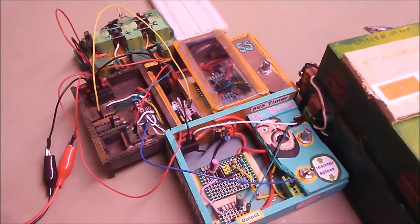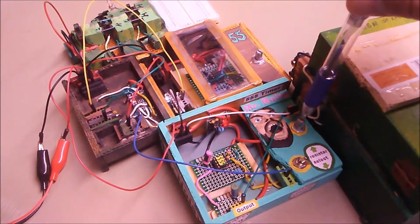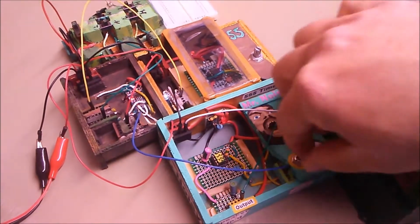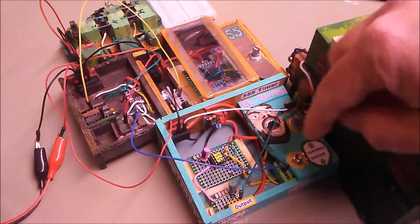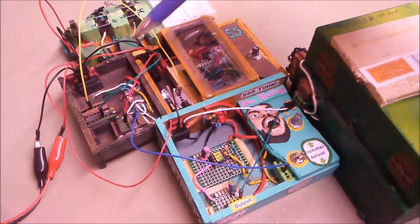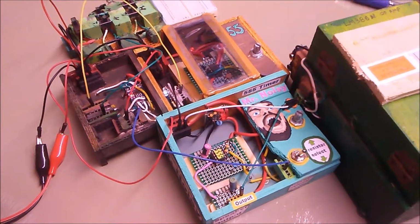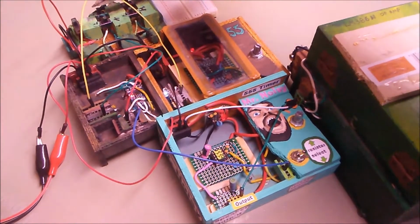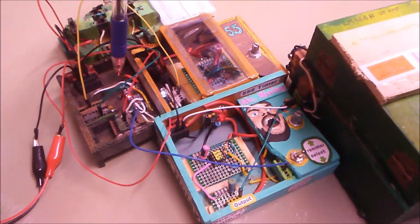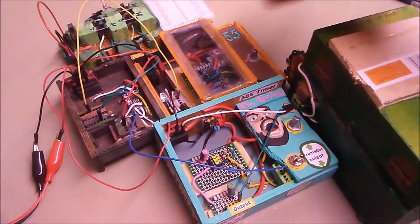So what I did is this 555 timer oscillator that can be manually adjusted as to the oscillation. I have this switch here which can send the signal out, and I'm sending the signal out to the digital potentiometer. So the digital potentiometer can be cycled up and down. I won't explain how that works. And that's what this device is here for, because it's just switching a high to a low, which will trigger the sweeping of this digital potentiometer up and down. So here it goes.